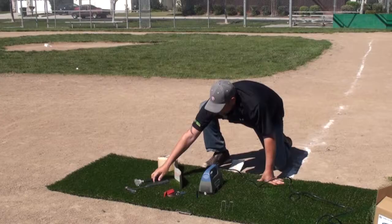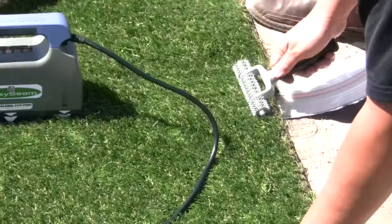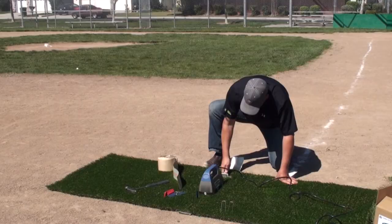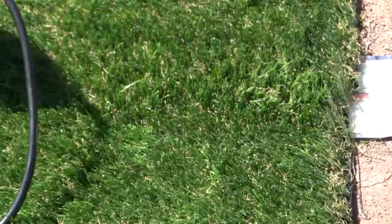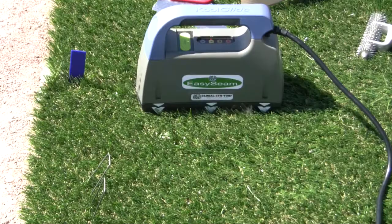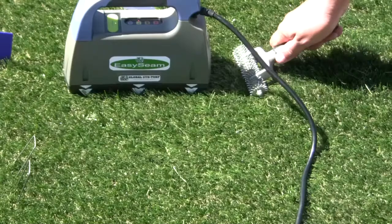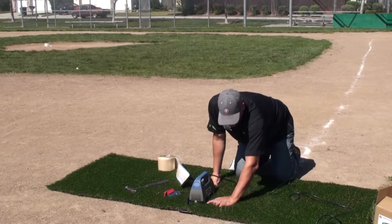One other thing — while we're doing the seam, I don't have to stand there and hold it at all. So what we do is we have a seam roller. We come right behind the machine and just roll that seam, pushing it down and making sure everything is nice and tight. If you take a look behind the machine, you can see that you cannot see the seam at all — it's all put together. So again, we activate it, move the guide up, finger on the back arrow, push the button, light goes on activating. Once that light goes out we're done in that area, and we just have our seam roller right behind. You can't see the seam at all. No glue, no mess, and one person can do a seam instead of three.